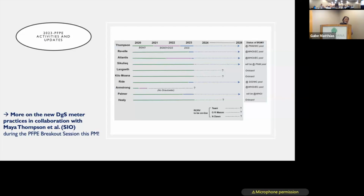the sensor for open ocean operations, because this is a company whose main clientele were in the industry who do surveys in very, very calm seas. So when they saw this ship motion on Armstrong, the sensor got overwhelmed. They had to expand the dynamic range to accommodate the normal UNOLS or ARF operations in open ocean. And since then, it's been working very well on Thompson.